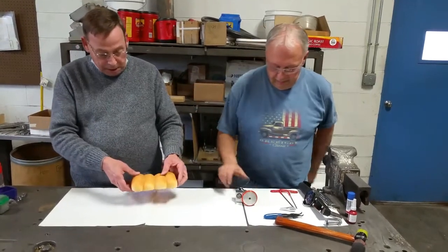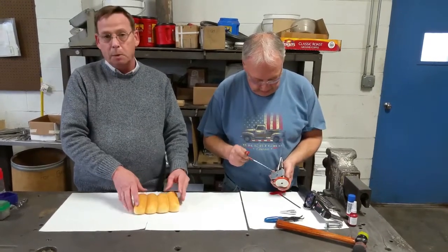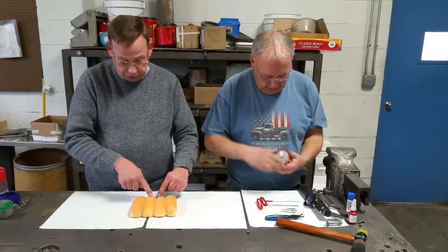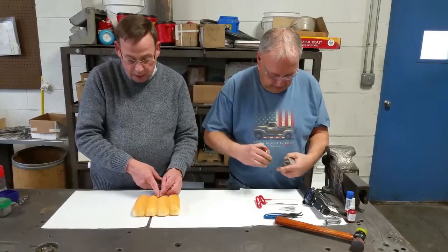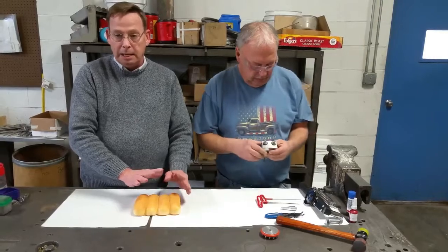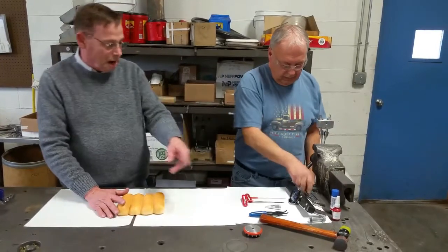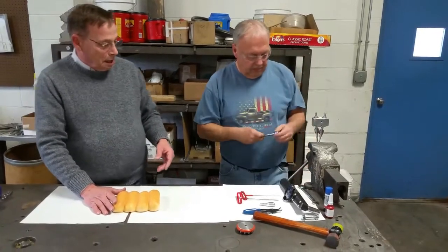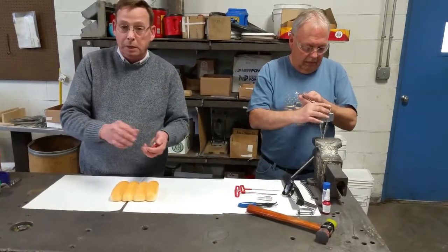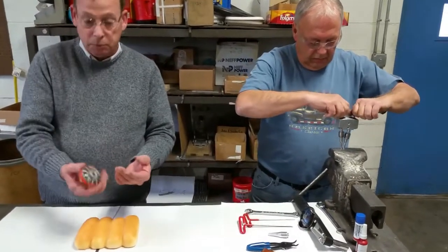On a splitter, the best way to remember it is the technical name for it is a separator. So if your buns are coming towards your slicer in this direction, them screwdriver blades need to be turning this way to separate that bun. If they're turning the other way, it's just going to mangle the top of that bun and nothing's going to get done. We're going to take this splitter apart now — we've already took the drive off of it. To change the rotation of the screwdrivers, you just flip-flop the drive pulley on it.